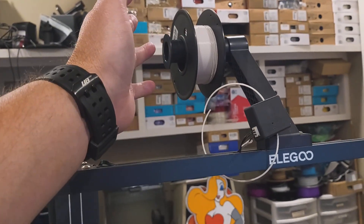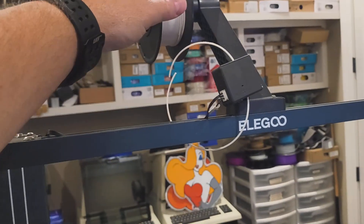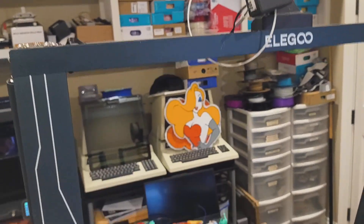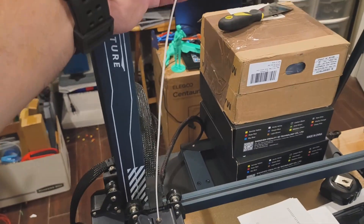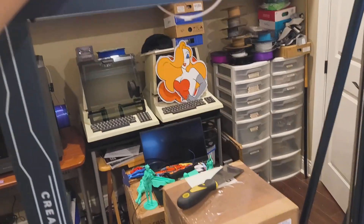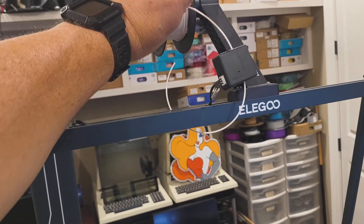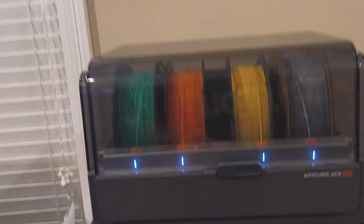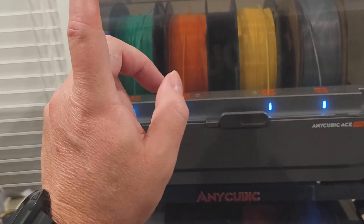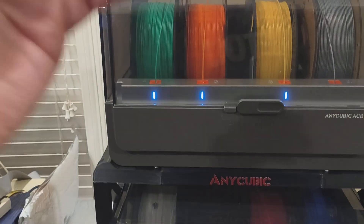An example of that is on the Elegoo — it's a single colour printer, printed in white. It did everything fine, but then it was sitting idle for a couple of days and the filament broke twice just sitting on the printer. It snapped after the filament-out sensor, and also between the spool and the top of the sensor — for no reason other than just the tension on the filament. That's probably a lot of the problems with some of the breakages — it's naff filament. It's brittle, it doesn't like being bent, and if you just leave it idle, like with the green and the orange which weren't being used, it's just going to break at a point where there's tension on it.